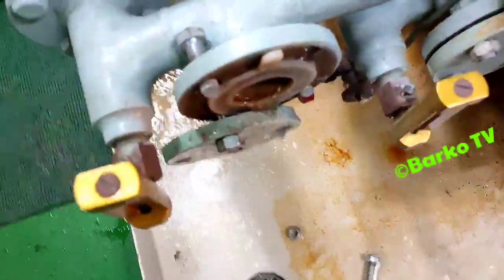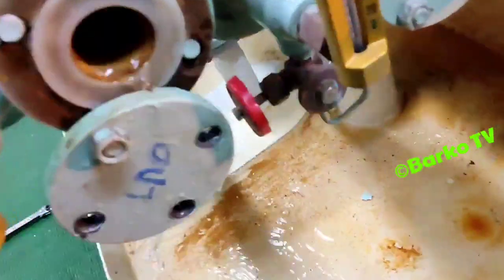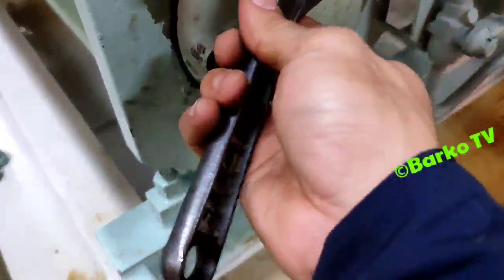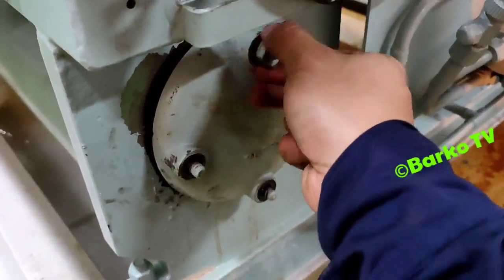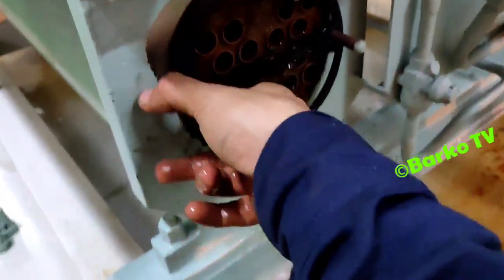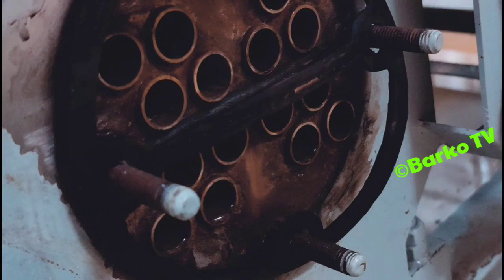This is the reason why it is high temp. It's triggered high temp. It's because of the seawater supplied by the dockyard. For the meantime, they supply seawater because we are in the dockyard, and the cooling for this condenser is seawater. That's why our condenser is super dirty. We found another gasket. It's a rubber gasket. That is the gasket we need to use. This one. This is the new gasket.